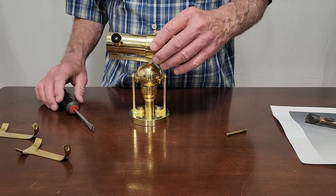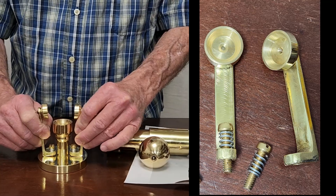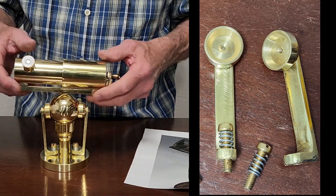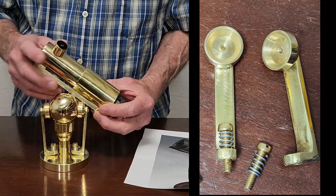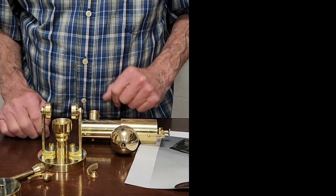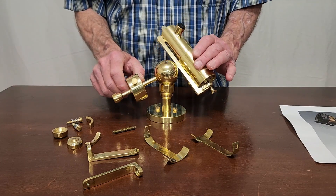So this solution will work. My next iteration of this mount ended up being a couple of spring-loaded arms. There are some pretty tough little springs in there, and I put some pressure on there. Now you can put the ball on — this has quite a bit more pressure. But this whole thing up here, being brass, weighs a pound, which for this size is pretty heavy-duty. No matter how much I tighten those, there just doesn't have enough tension. So that's why I ended up going with a counterweight. Perfect — it's beautiful, it works superbly. I can always opt to go back to a number of different static display options, but I think I prefer this one as my final result.